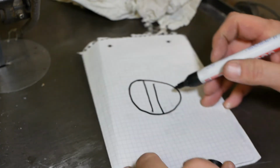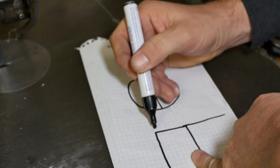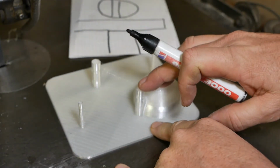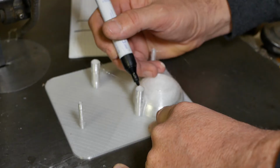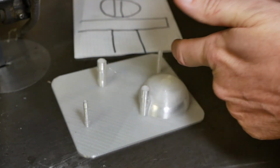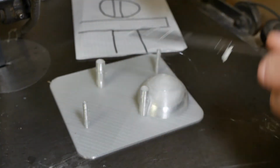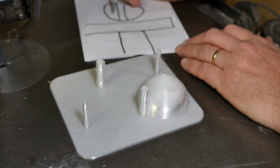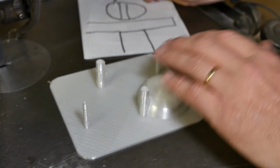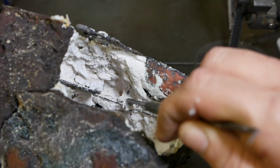And what I'm guessing is the join between the runner and then the plinth here, which was hot glued. That'd be this surface here. What I'm guessing is that the hot glue might have only been across the middle and that plaster came in from both sides. What I really should have done at that point, I guess, would have been to stop, go down there with a sharp object and just break it out. The two broken out portions would probably have caused a defect, probably in the plinth, but that would have been preferable to having that cold shut where the bronze only got down to here and then stopped.